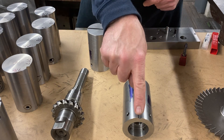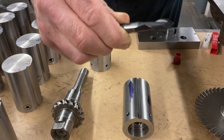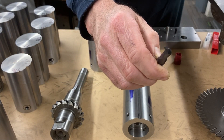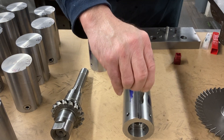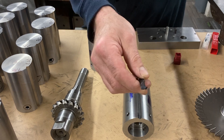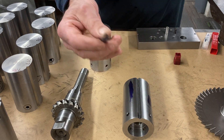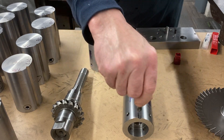There are a few ways you could do it. If it was set up just like this in this orientation, you can use one of these guys - solid carbide, two-flute, 45-degree, 90-degree included chamfer mill - and drill right through it like this. You could do it for one or two pieces, but this guy wouldn't hold up for 50 of them. It does not like plowing through solid material like this.